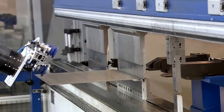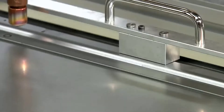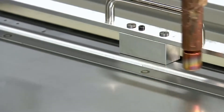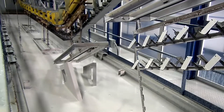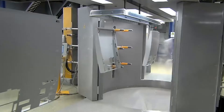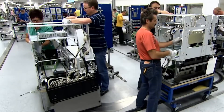Most of the non-electrical parts used to assemble ATMs are made of steel sheets. Workers place the steel plate on the cutter, which is controlled by a computer program. With the help of a laser, the parts are cut in the desired shape. The finished metal parts are immersed in a liquid which will protect them from corrosion. The parts are then dried in a special oven and painted.